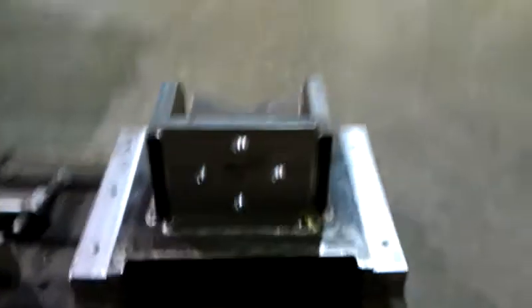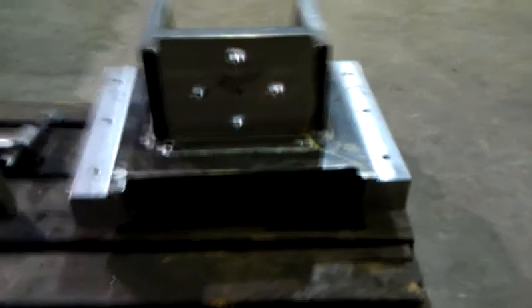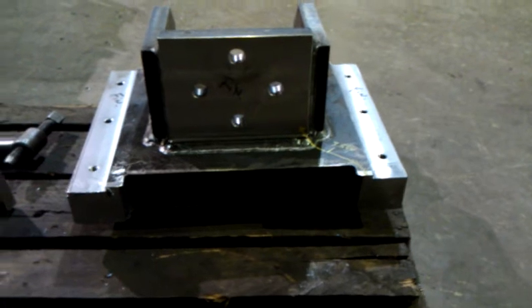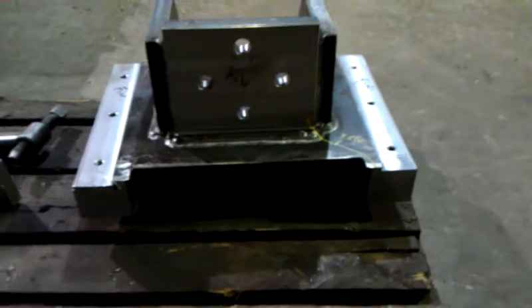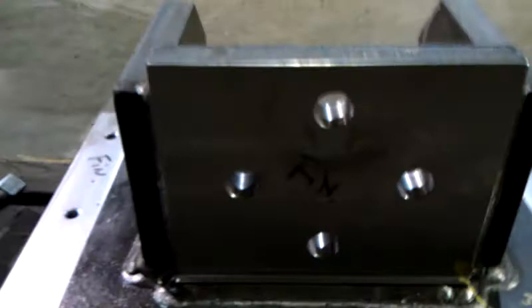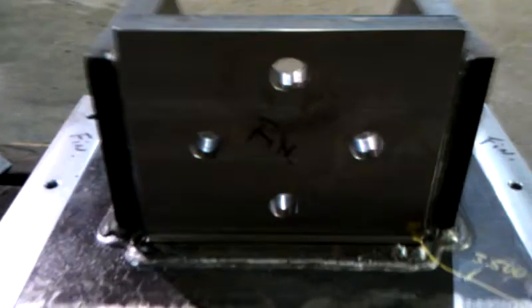This is a carriage cradle for a bar handler in a steel mill. The first setup was pretty self-explanatory. I just set it in this exact position on three blocks, and then shimmed the fourth block because it was hot rolled — it didn't sit flat. I skinned this pad here, this pad here, and then milled this pad three and a half inches deep.